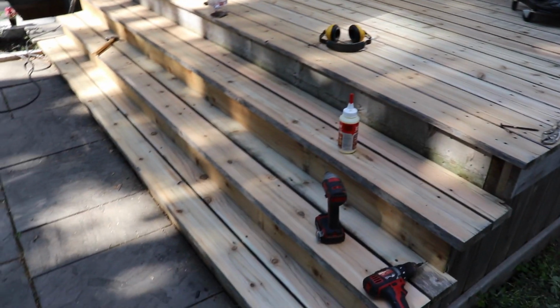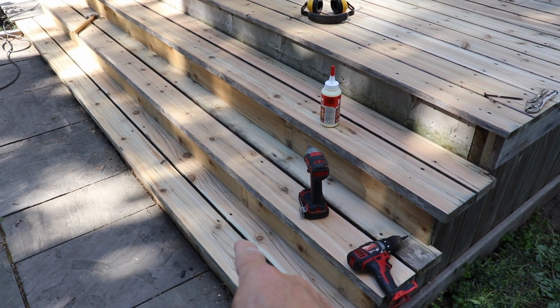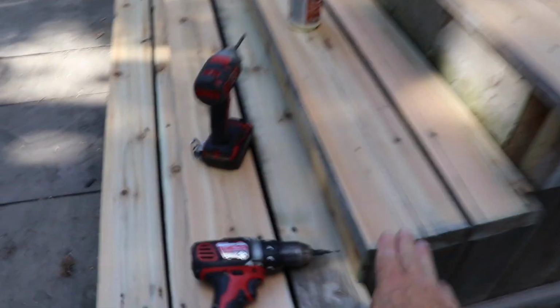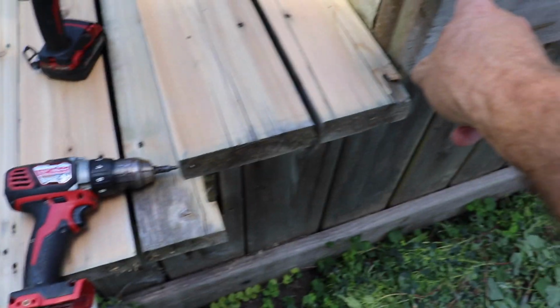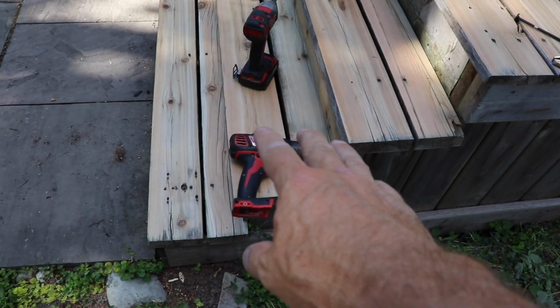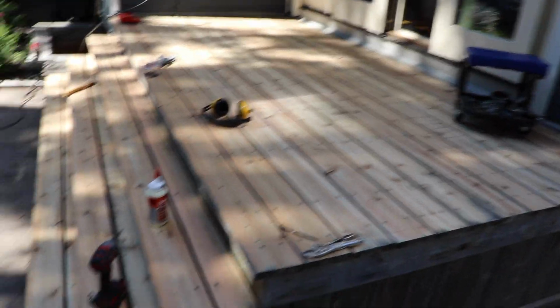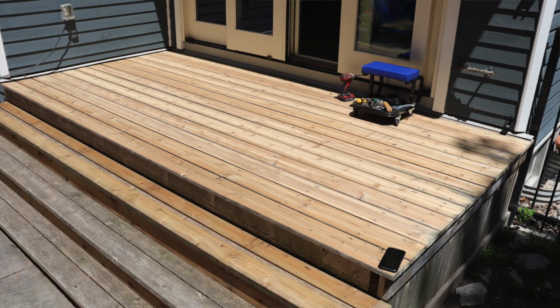Okay, so I've just finished putting on those bottom 2 runner boards. I didn't show you planing of those boards. The reason why I did these boards at a different time than these ones, these are 1.5 inches, these are 1 inch right there. So that required a different setup, just an adjustment on the thickness planer. So I ran these 6 later in the day. Just finished, as I said. That looks a heck of a lot nicer than it did before. I'll give you a before and after shot right now. Have a look at that. It's nice and smooth.